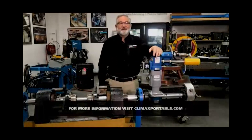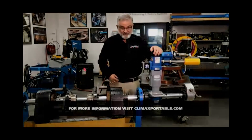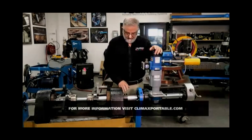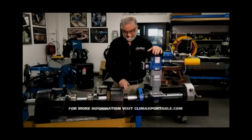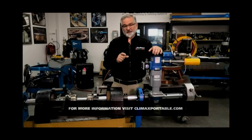Now that you've watched the video, we can move into our live Q&A session. The first question: what is the range I can use this head? So this particular head goes from three and three-quarter up to six inches. We also offer a larger head that's a slightly different style — it still clamps directly to the bar, has a two-slide length, and goes from six to twelve inches. So the overall range of this style of boring head is from three and three-quarter up to twelve inches.